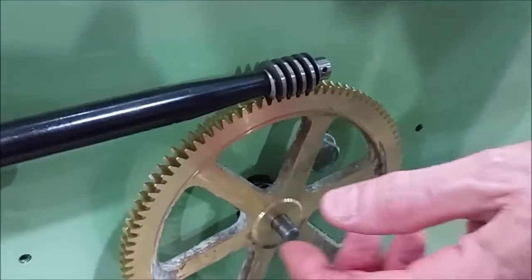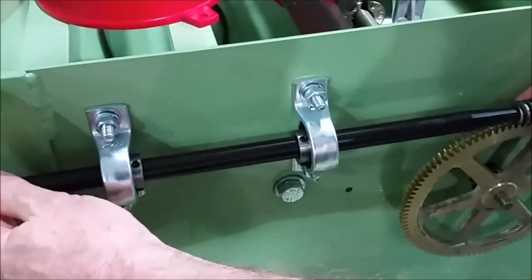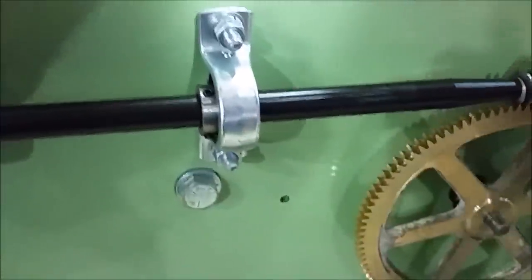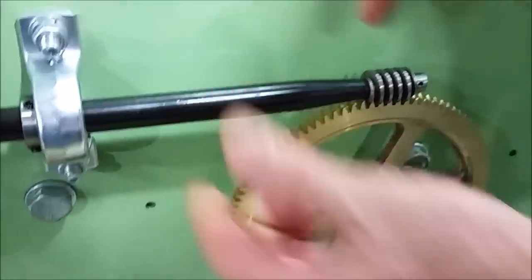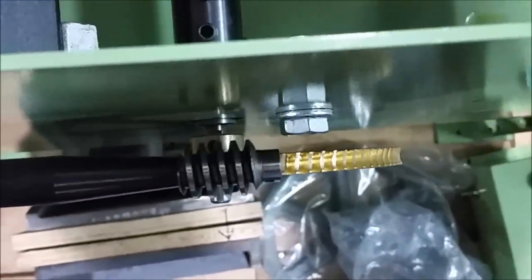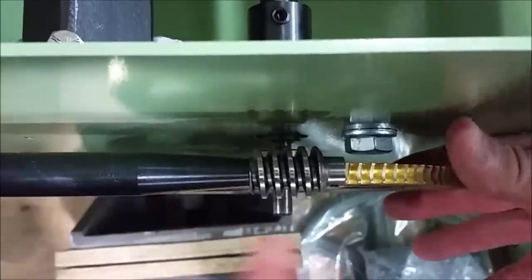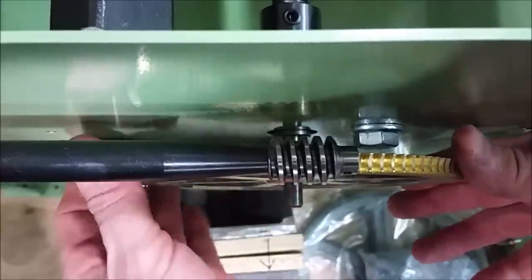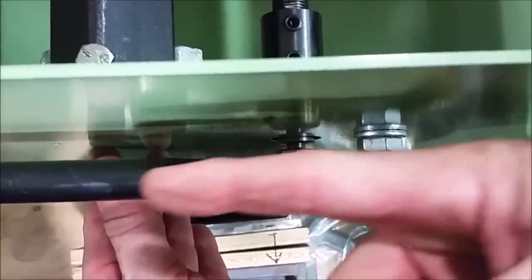Now what we're going to start with is just simple concepts here. These four bolts holding the two bearings have slop in them, so you get a lot of adjustment. If you look at the gears, you can see how much they move with just a little bit of movement here. That's how you get your mesh on this end. When you look straight down, what you want to see on your worm gear is that the worm itself is centered right over this shaft below it — the center of the upper gear is over the center of the lower gear.